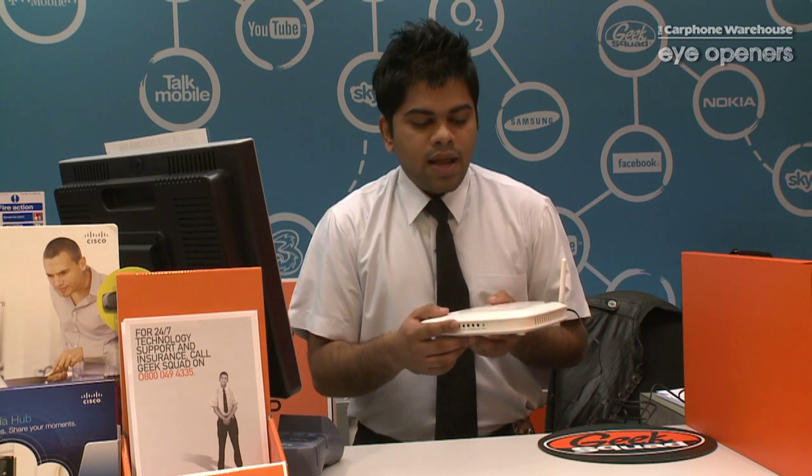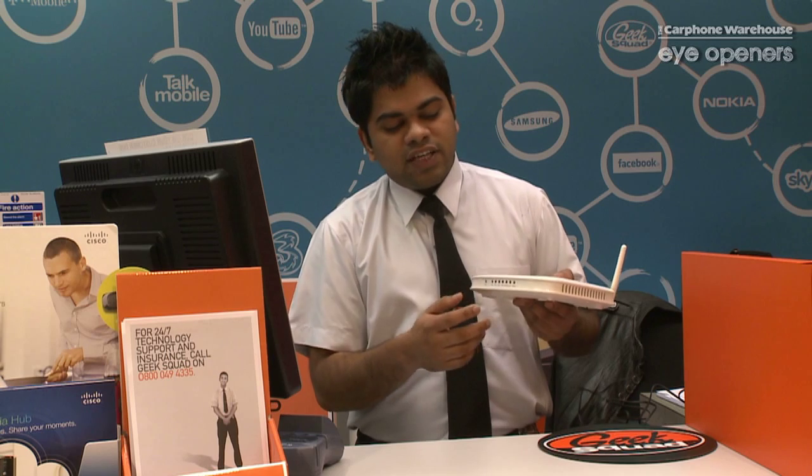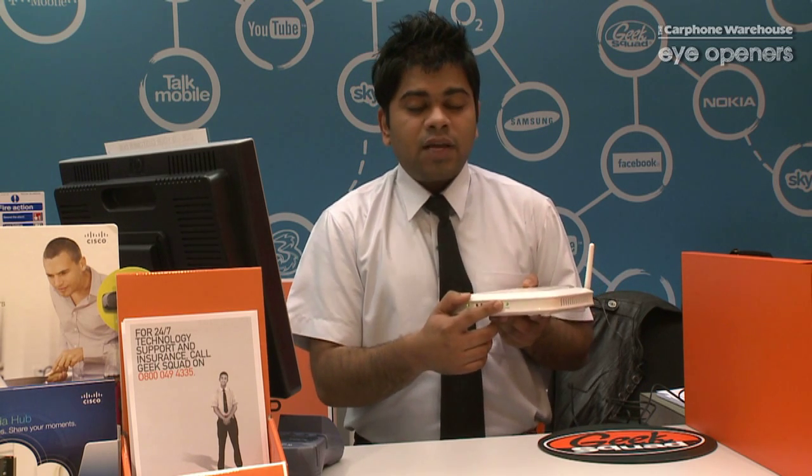In the lounge or living room, plug that router in and see if you do get the sync light solid or the ADSL light solid. If the light becomes solid, that means you're in the business again — it means you don't have any problem from your service provider, but it's a problem on your internal wiring.